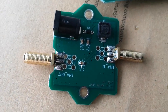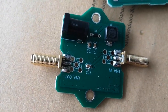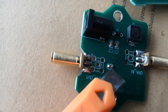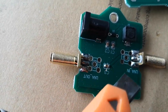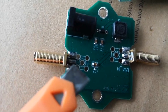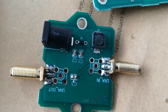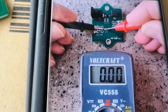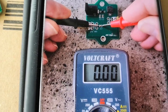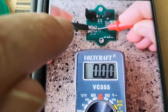I thought maybe it didn't have a DC blocking capacitor, but it does — it's very, very small and it's located around about here. That DC blocking capacitor is meant to prevent the DC supply going to the antenna from reaching the receiver. The problem was nine volts was coming out anyway, so I tested it with the multimeter, and you can see the resistance between the two ends of that DC blocking capacitor is zero ohms, which is not a good sign.